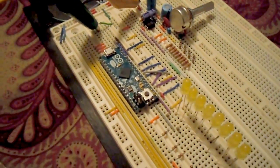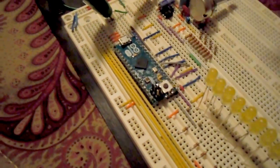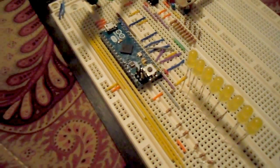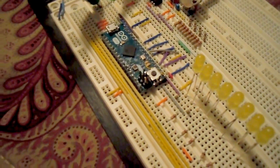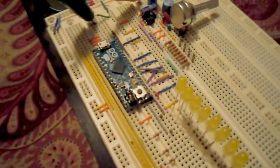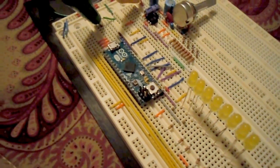The songs are stored in the flash memory on the Arduino. They are compressed — there is some bit manipulation. The samples are not modified in any way, but some of the track data and pattern data is compressed down. The gentleman that wrote the software has a converter to convert XM files, S3Ms, and .IT files, as well as mods, over to this format.